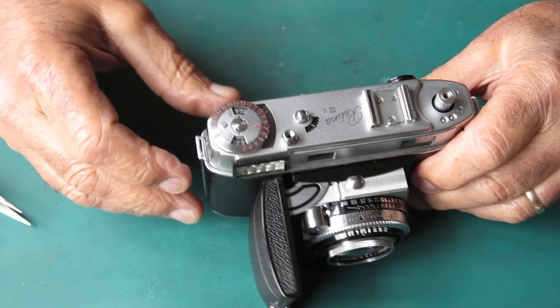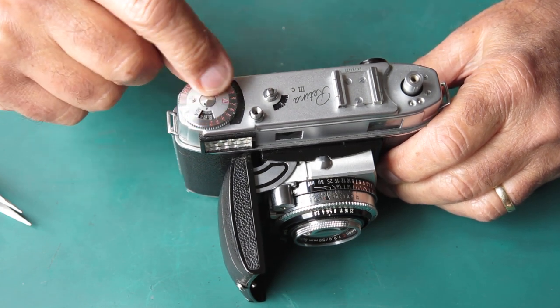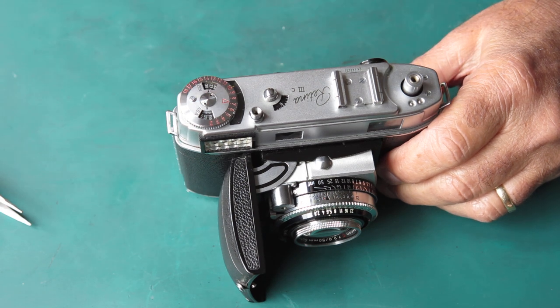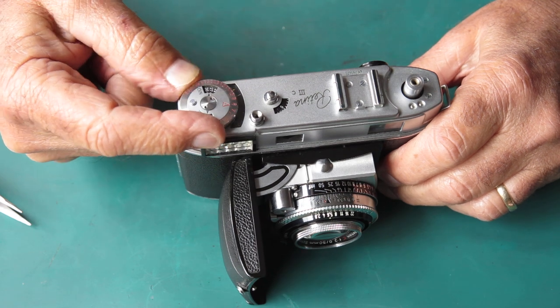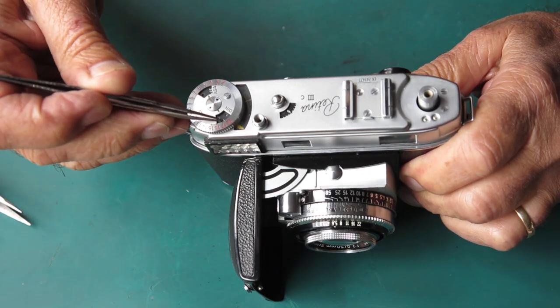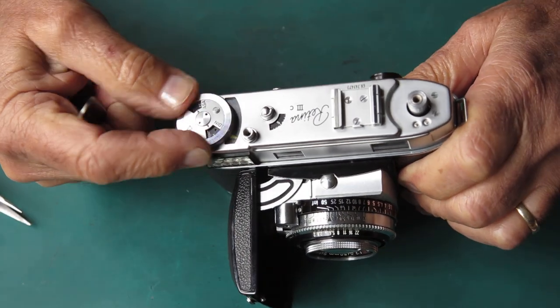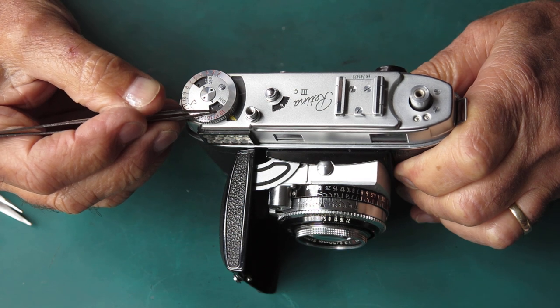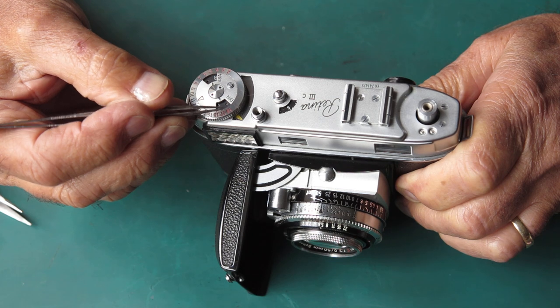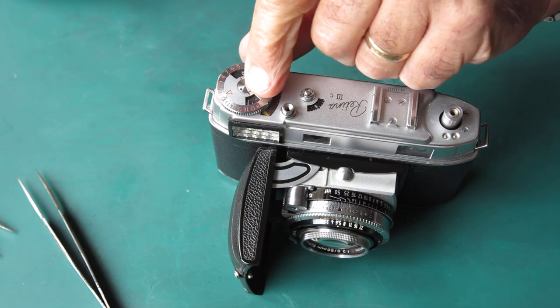This screw on top of the meter - we need to deal with that. As soon as we remove it, there'll be no friction holding the dial at the bottom in position, so you'll lose the setting of the meter. I normally make a note of where things are. I'm looking for this little tick mark here next to the 1300 ASA, and with the dial rotated fully clockwise I'm checking where that tick mark comes up against - it's about midway between the 17 and the 18 mark. Now I know where to put it back so the meter setting stays exactly the same.